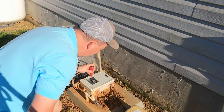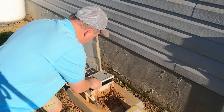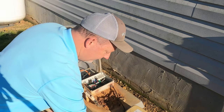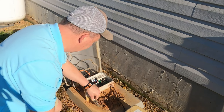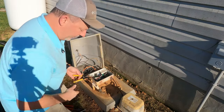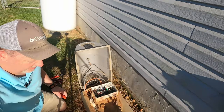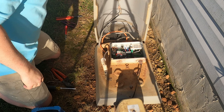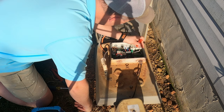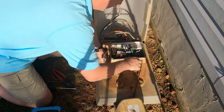Ants have decided to grow under here, I need to clean that up. Inside the control box it's got all kinds of timers and relays and stuff to turn the pumps off and on on a timer. So let me clean that up right there and I'll be right back. Alright, I got it cleaned up and now I have to unwire it from the terminal strip. Get the power off — okay, the power is off.